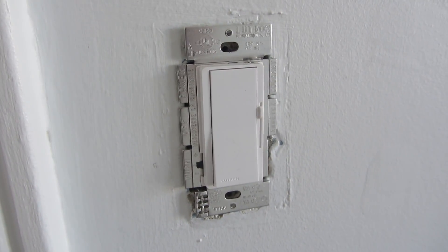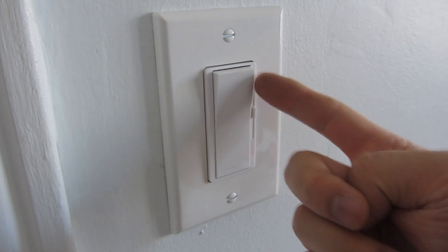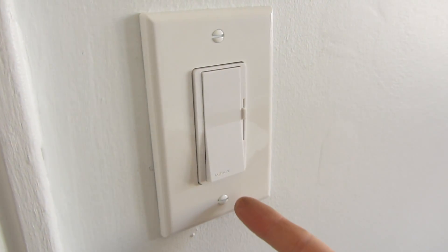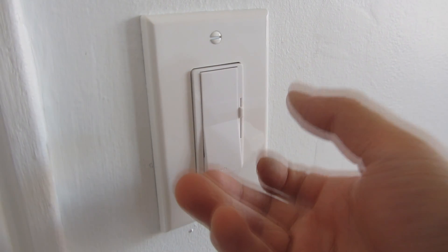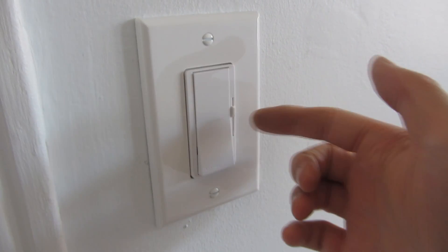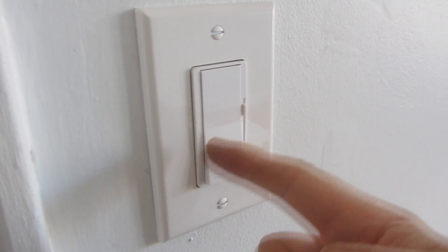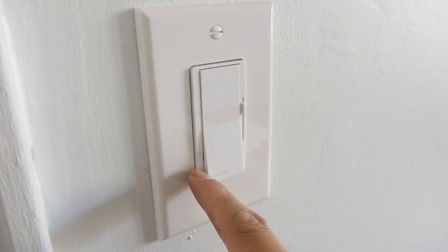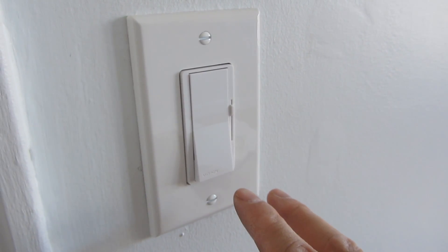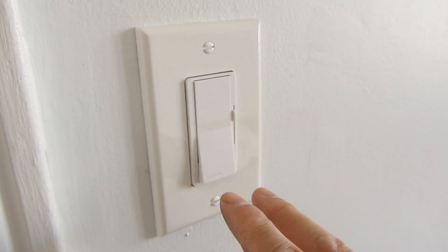I've put on the cap — here's the finished product. I really want to emphasize: the top sticking out is the off position, and pushing it so the bottom sticks out is the on position. The only way around that is to physically turn the switch upside down — switching the wires will not help. Keep in mind that reversing it will also flip the dimmer slider position and the lettering upside down. I'll have all the links in the description and I hope this helps — please subscribe and thank you for watching.